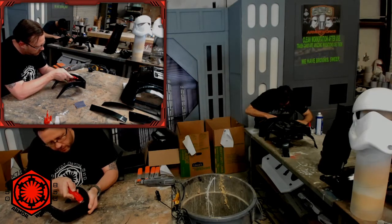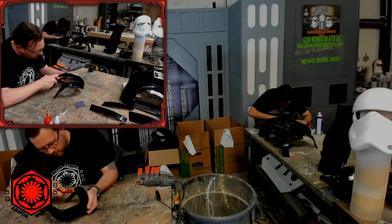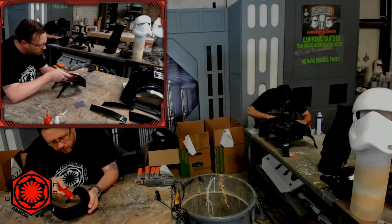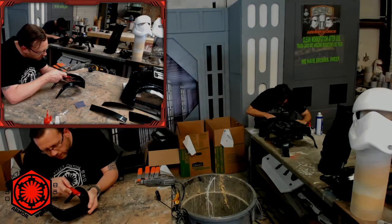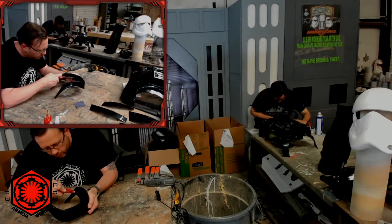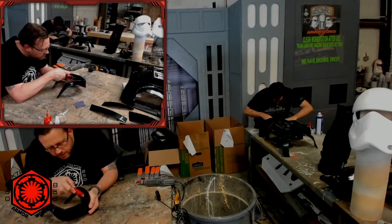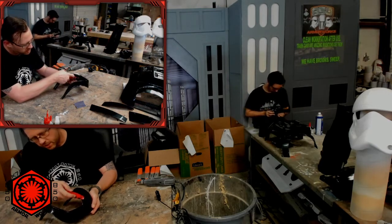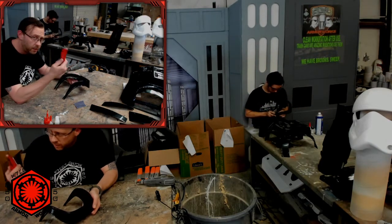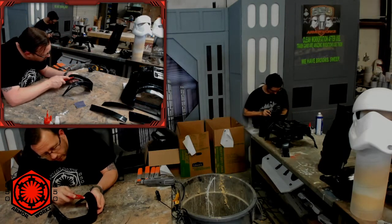It's never fun. So I'm getting a little too deep for the first cut on this one. And I'm running parallel. Making sure that we don't have any curls. If I were running downward, we may have little curls left over from the plastic. This is one of those times where I'm glad the plastic's slightly thinner. See, when I only went through that section, it popped through and I was able to use the sharp blade. Sharp blades are your friend. I switched these over to a sharp blade forever attempting to cut.